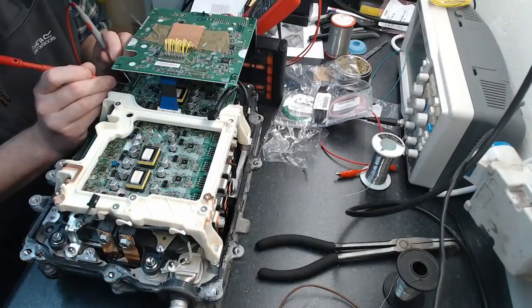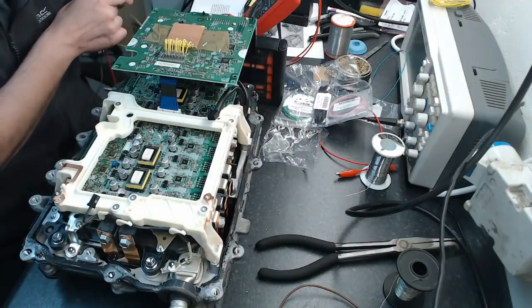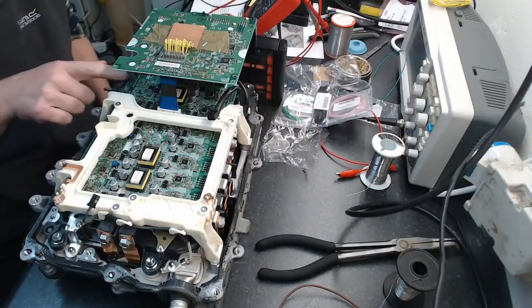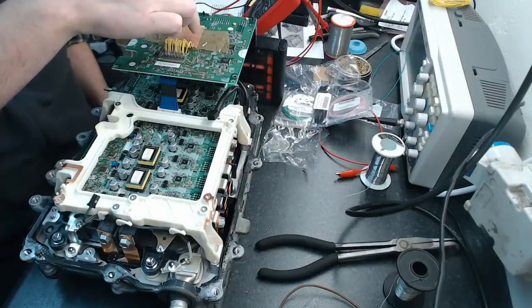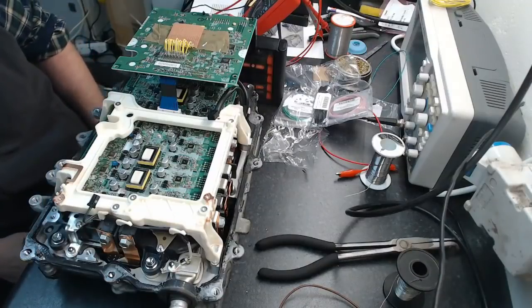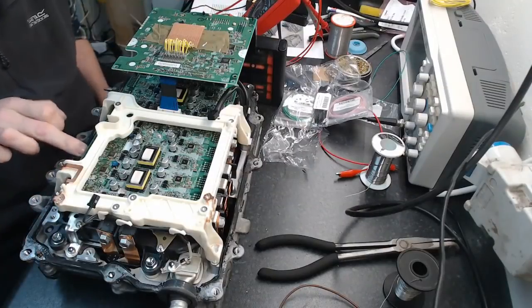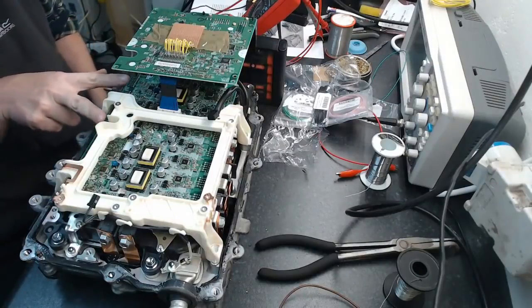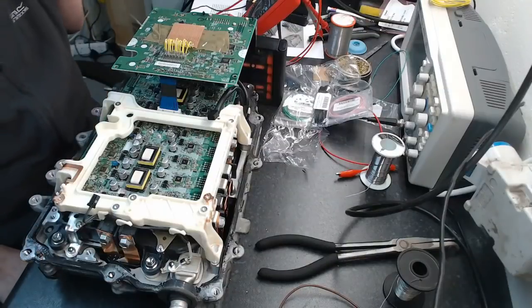One of the other things is that, rather weirdly, these do not use negative gate drive. They just go plus 15 volts to ground. So, the power's on. I'm going to assume, and I know where that's going to get me, that it's numbered from 1 to 12. So 1, 2, 3, 4, 5, 6, and then 1, 2, 3, 4, 5, 6, and then down here is the booster. I have a picture here; the one nearest the power in is MG1. So this is MG1, this is MG2. There's 6 transistors here, 6 here, and then 2 here, giving us a total of 14.